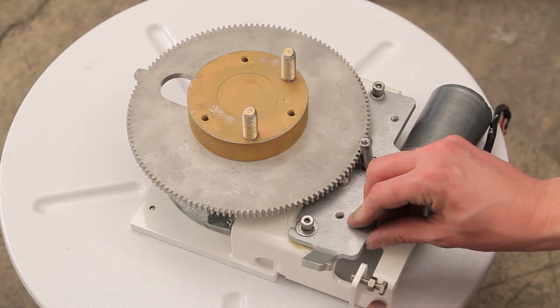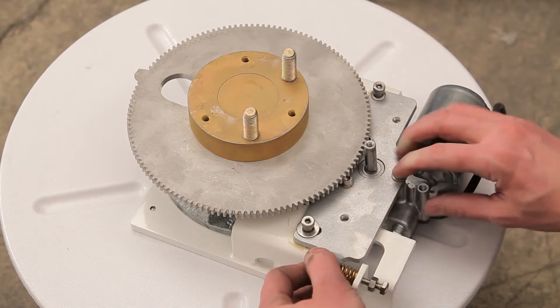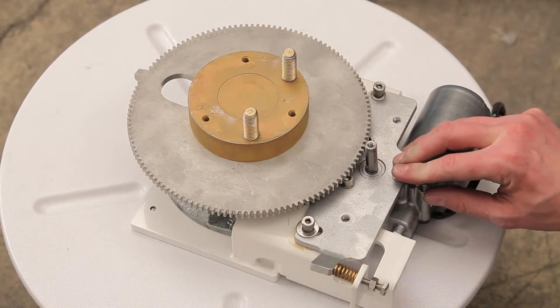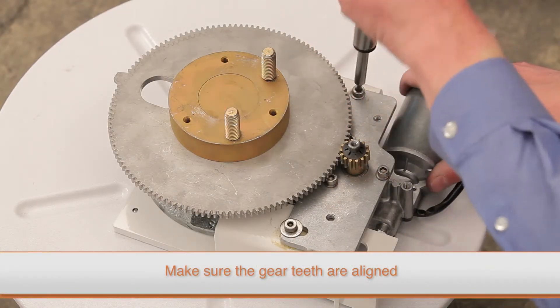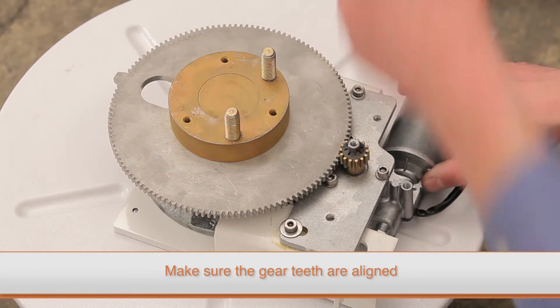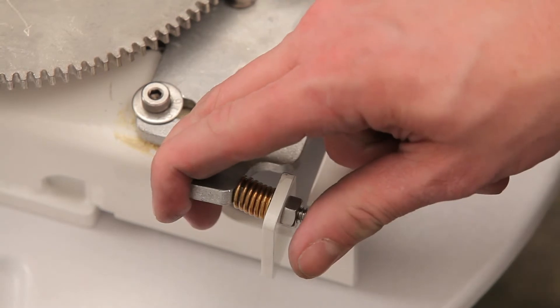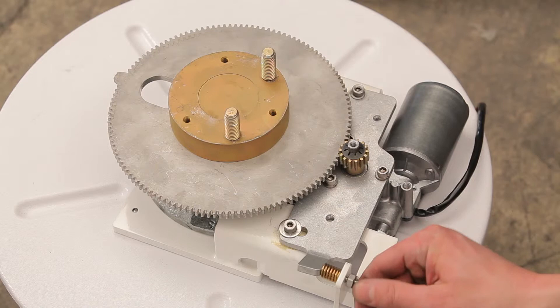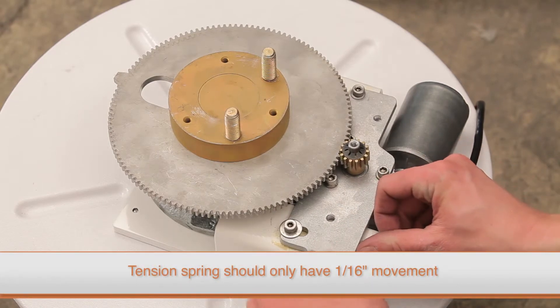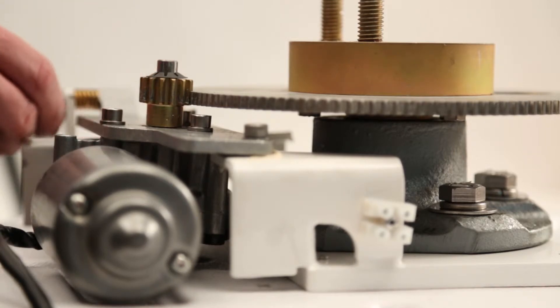Next, insert the tension spring onto the tab in the mounting plate and slide the spring over the tension adjustment bolt which is installed in the base frame. Position the mounting plate so that the teeth of the small gear align with the teeth of the large gear so that the gears engage without binding. Once the tension adjustment bolt is properly adjusted, make sure to tighten the lock nut against the base frame. Tighten the mounting screw only enough so that the mounting plate has 1/16th inch movement, allowing the tension spring to align the gears so that they engage without binding.